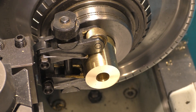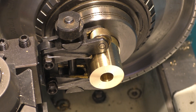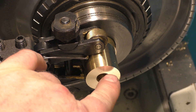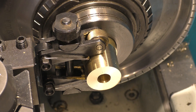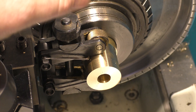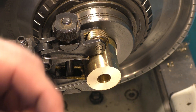I prepped a bit of stock and we're going to knurl the outside of it. My brother-in-law really appreciates knurling, so we're going to knurl it for him. Then we're going to bore the inside out. I wanted to wait until the knurling was done because there's a lot of pressure squeezing it - this is a pinch style knurler - and we don't want to crush it. We need to open this up to about 0.650 before we tap, and I'm only going to tap threads in the middle for maybe one or two threads so it'll be really easy to spin on.